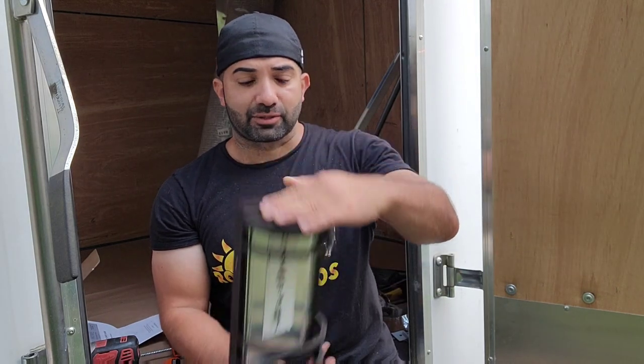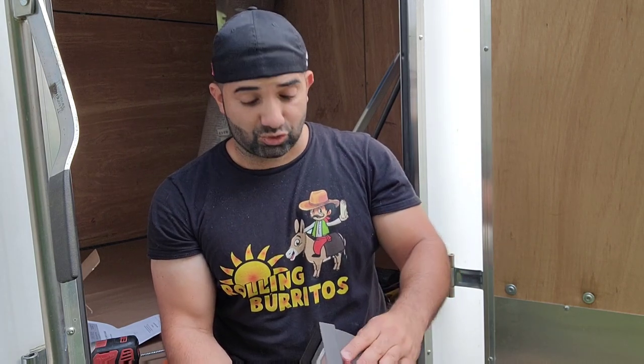Okay, so the light towards the back wall, towards the back door, is gonna be a little bit different in the installation. And the reason is because we're running the rope light through that light fixture, being this one right here. So we have to do something a little bit tricky, but it still works because we're gonna silicone everything, make sure everything's watertight as well.